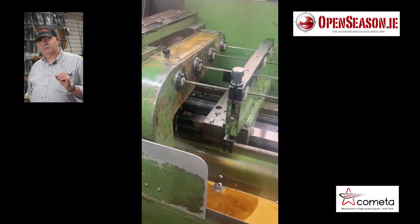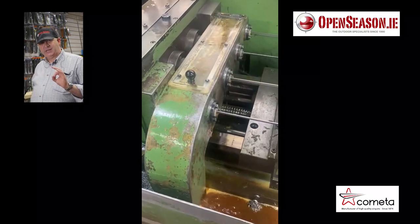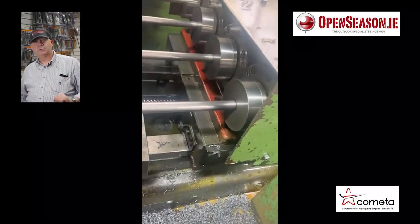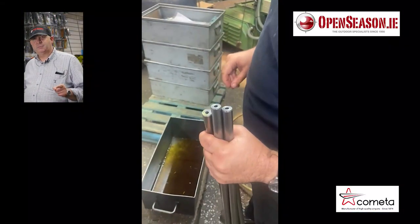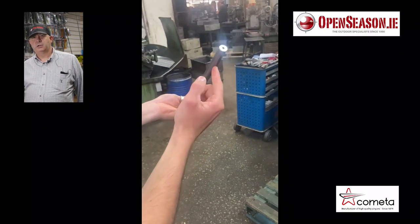When the barrels come out from this process, they're smooth bore, just like an old-fashioned musket. And the barrels are also still quite thick. And when we saw it happening, we were wondering, how are the barrels so thick like a bull barrel? But we'll find out in the next step exactly how they become narrower. So we've just drilled out our four barrels at a time, and we've taken one. You can see the bore down the center of the barrel. The heavy diameter on the barrels, even after being drilled, they're still quite chunky looking, like, as I said, like a bull barrel.